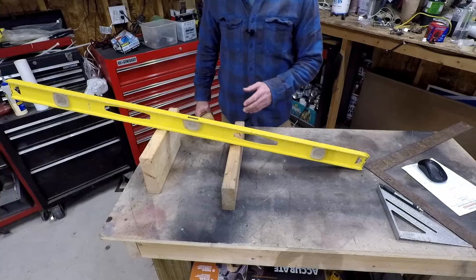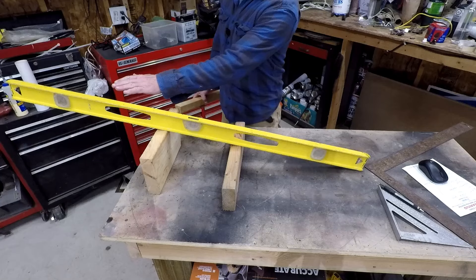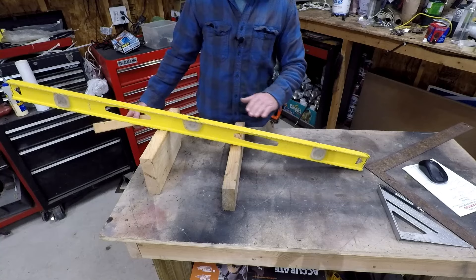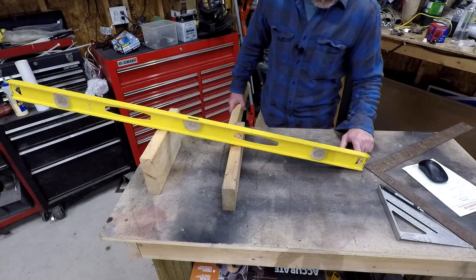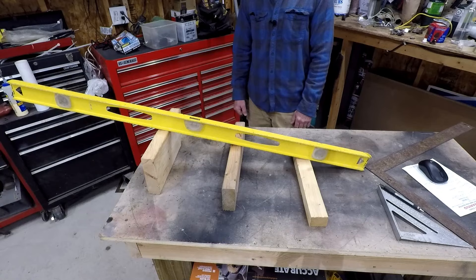Because we're on a level plane, I've got to kind of mock it up. But if you were to plane across, you take a four-foot or six-foot level — if it's a big job, use a straight 2x4 if you can find one — and float it across. So these would be my rafters on the common section of the addition. We plane it through, hitting here, here, and this would be where it hits the roof, but we can't go that far because we have to sit on a valley board. So you slide your valley board in until it hits — that's where you want to be.